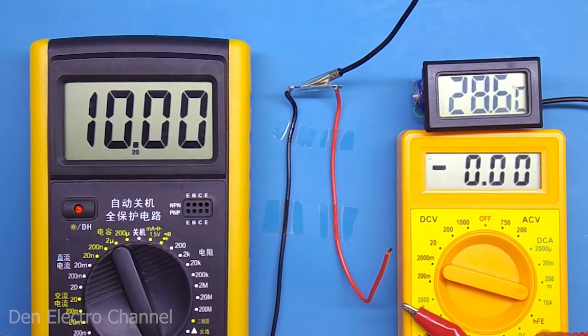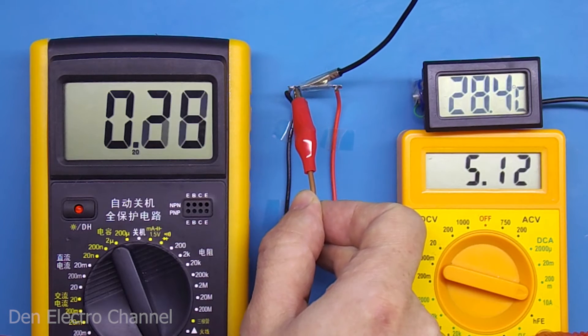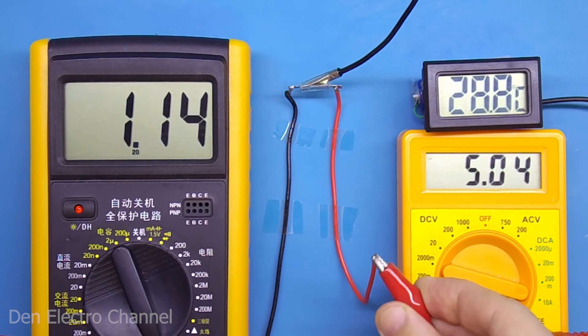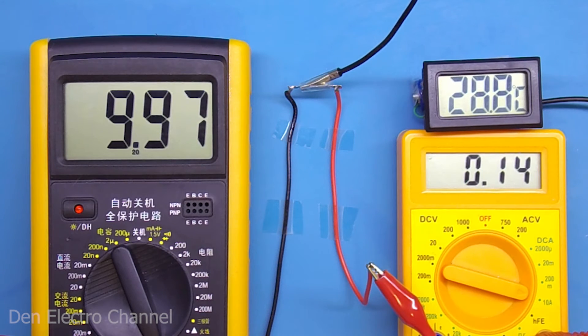In the next experiment, I want to see how quickly the short circuit protection will respond if the fuse is cold. The power supply voltage will also be 10 volts, and I set the current to the maximum — 5 amps. Now I'll just short the probes and the ammeter will show this current. I connect the fuse. According to my calculations, the protection worked in 4 seconds. The fuse has warmed up again, but unfortunately the thermometer does not show this — there is very large inertia in its measurements, and it cannot immediately display the desired temperature since the temperature sensor must still warm up.